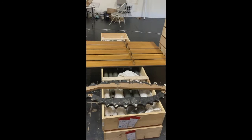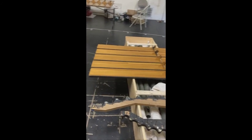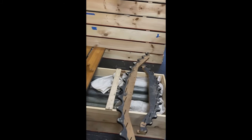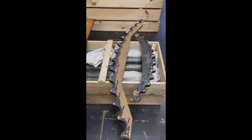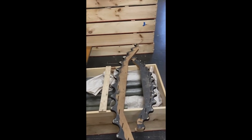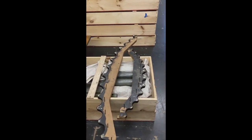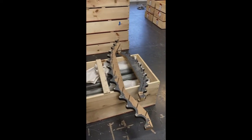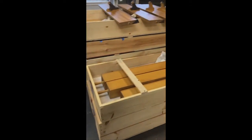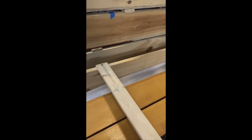The guys have the framework in for the swell shades — the swell and choir shades — and you can see some of the shades here. There are crates of pipes. Here are the braces for the facade pipes, located about 8 to 10 feet up. There's a clip on the back of each pipe that hooks into pins that stick up behind each pipe. Here we can see some of the wooden pipes, all cleaned with the stoppers replaced.